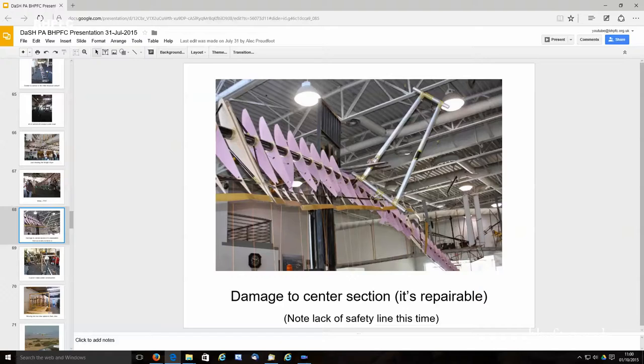And it basically was just like a jigsaw puzzle piece. These didn't even have any separate pieces. The wingtips, where a bunch of pieces broke, it was a little bit more challenging. But we just had to glue these back together, gusset it with a little bit of balsa wood, and also a little bit of very thin plywood on the tops and bottoms. We probably added on the outer wings maybe 20 or 30 grams to each wing, and on the inner one where we had to strengthen the center section, maybe 50 grams, but it didn't really add very much weight to fix it, and it only took about a day for each wing section.